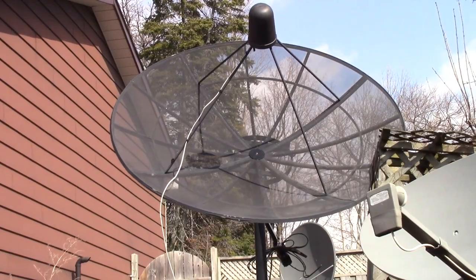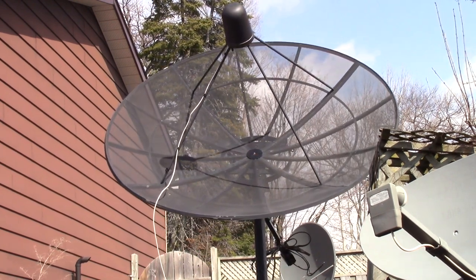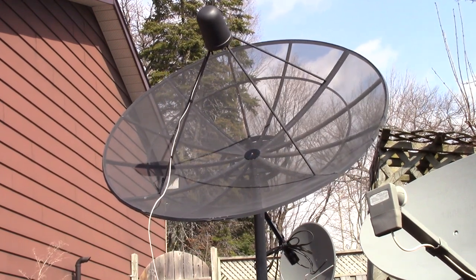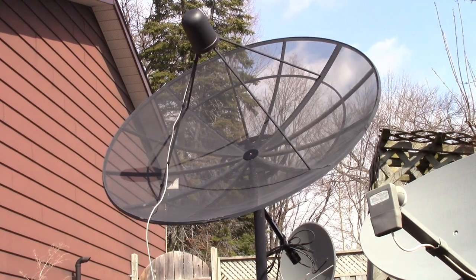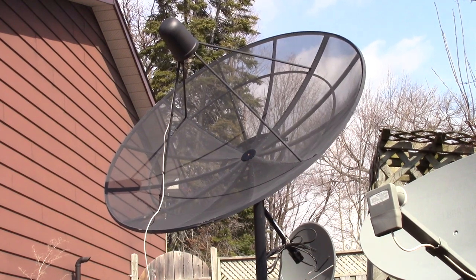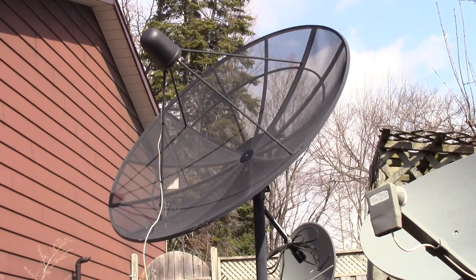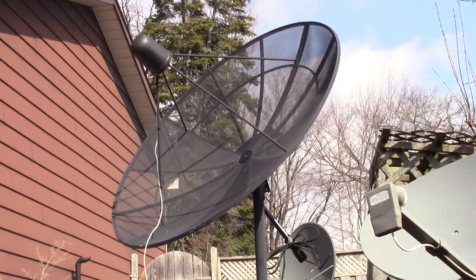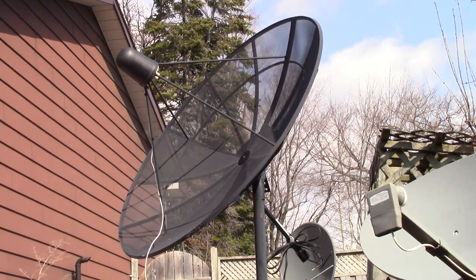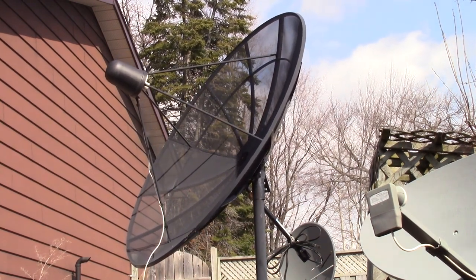One really good thing about having a CKU-band LNB is if you're searching for wild feeds, it gives you that edge when you're trying to track a satellite on your geostationary arc to make sure that you're locked with your C and KU-band transponders. For example, there might be a satellite that doesn't have any KU-band transponders active — you can find it with your C-band part of the LNB and then scan in your KU-band transponders that might be backhauls or wild feeds. These LNBs are great for feed hunting.